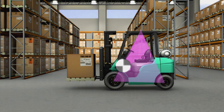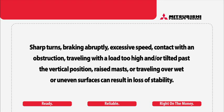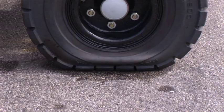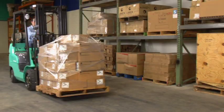Longitudinal stability can be lost when the center of gravity moves too far forward or back and crosses over the stability pyramid, causing the lift truck to tip forward or backward. Sharp turns, braking abruptly, excessive speed, contact with an obstruction, traveling with a load too high and/or tilted past the vertical position, raised masts, and traveling over wet or uneven surfaces can result in the loss of stability. In addition, unstable loads, driving on ramps, and low tire pressure on pneumatic lift trucks can affect stability and result in a tip over.